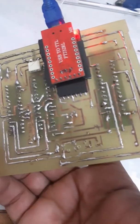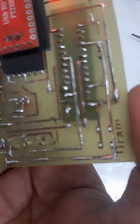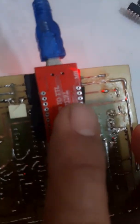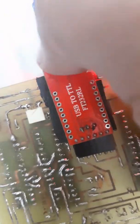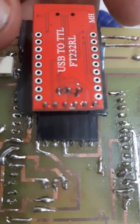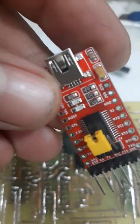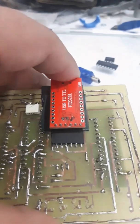On the backside you can see the circuit I designed. It doesn't look very professional, but I made it for test purposes and my name is printed on it. This PCB backside I already explained — this is a USB to TTL converter, also called a serial programmer, which I am connecting to my laptop. I made this device as plug-and-play type. You can see there are male-female sockets, so I can remove the TTL converter easily. This is a dual 5-volt and 3.3-volt TTL converter — easy to plug in and it works.